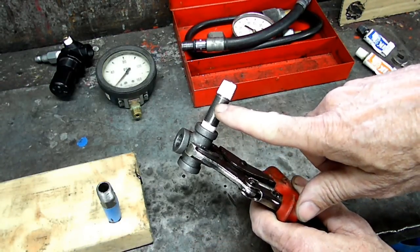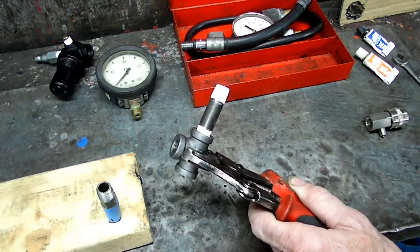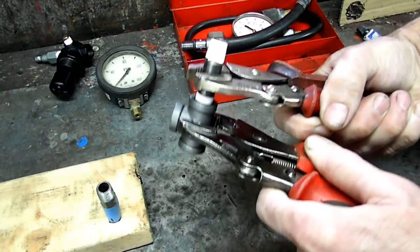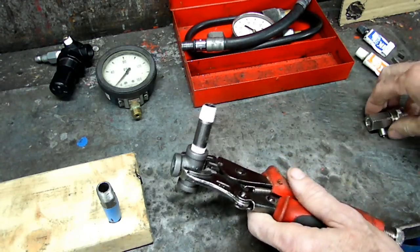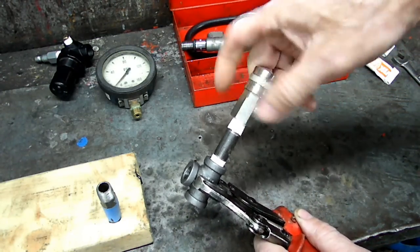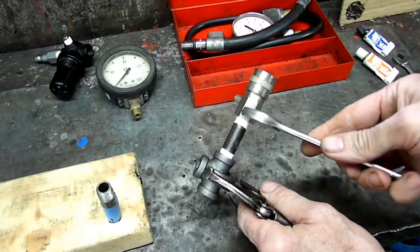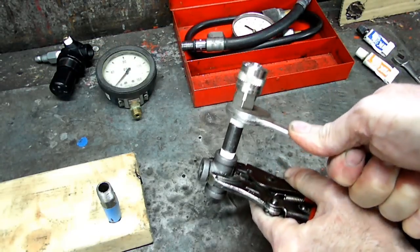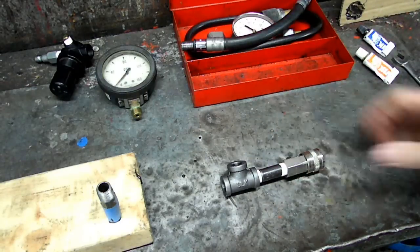While that's hardening, I'm going to put the other two-inch long piece of pipe into the T-fitting. We've got our Teflon tape there and we'll tighten that up. Now we can put our quick disconnect on the end of it and tighten that up. There we go — that's all set.